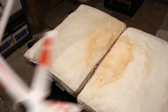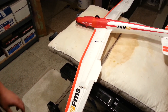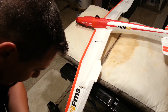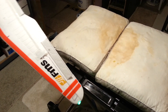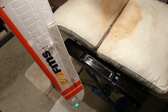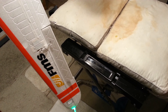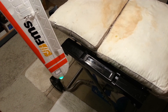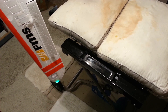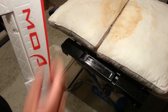So now I need to get this in a situation where I can work. Just push my table saw back a little bit. I want to take my CA — make sure it's not all gooped up. I've got it on there, just trying to find a spot to do this so I don't waste a ton of it. I don't know if you guys can tell in the video, but this really works well. Give it some kicker. If you have a Q-tip, you can absorb just a little bit of the excess kicker.